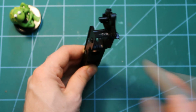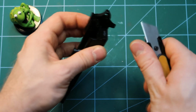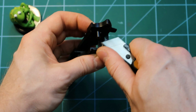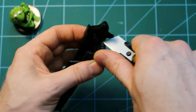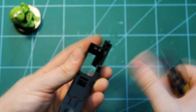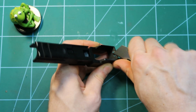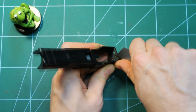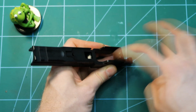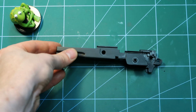So I have my two holes, you can always measure to be sure that the holes are in place. And I made the first cleanup. One more thing, you need to make sure that there is no debris sticking out after drilling these holes, because it might influence the position of your conversion. And this goes for both sides. So obviously on this side, you also don't want to have anything like this. It's usually good enough to remove it with a knife or some deburring tool.